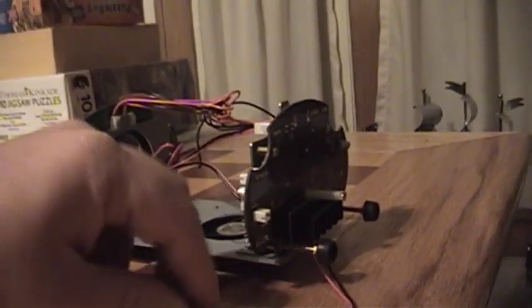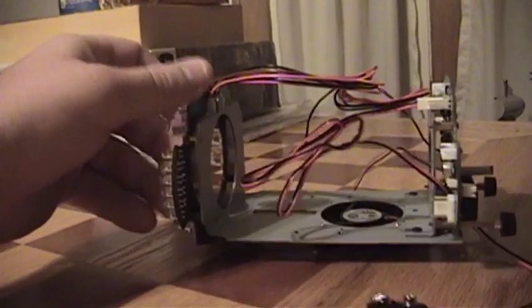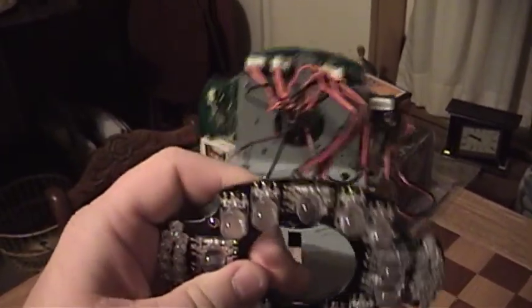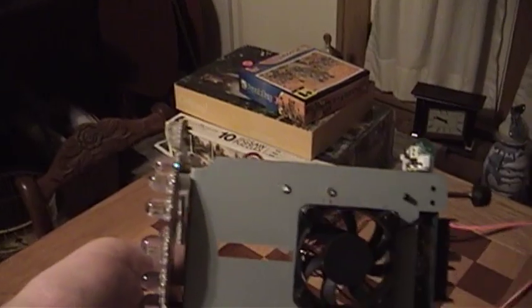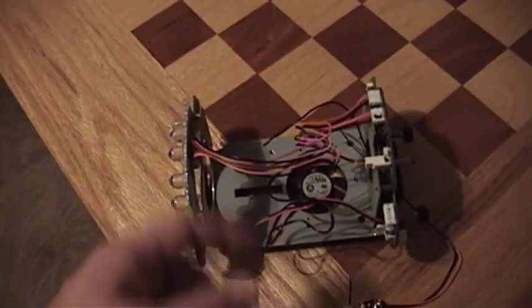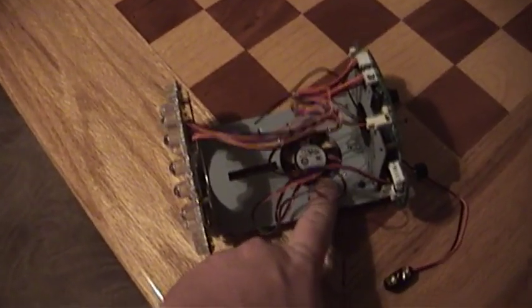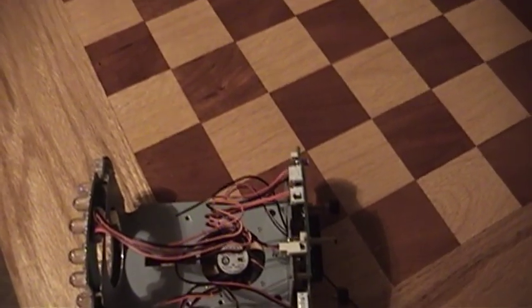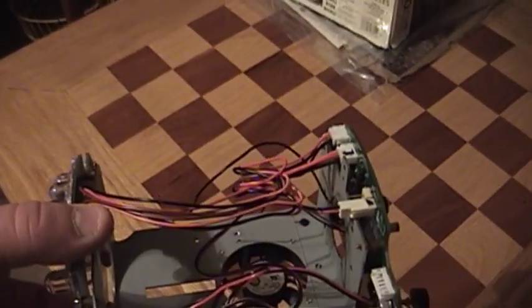Should be an incredible light show. I've got a battery connection here to go to a 12-volt pack. I actually bought some rechargeable batteries for this purpose, but I haven't received them yet, so right now I'm going to use some alkalines. That's not a nice thing to do to alkaline batteries — the device's power consumption is around 10 watts, which works out to around an 800 milliamp consumption figure. With all those big LEDs on the front, I can't see how it uses so little power. I know that when it's in operation, not only does this little fan come on — which is completely blocked off in the camera's normal position — but the board in the back with the voltage regulators also gets very, very hot.